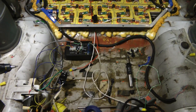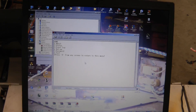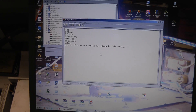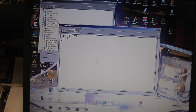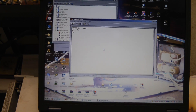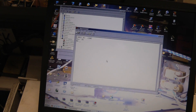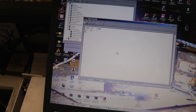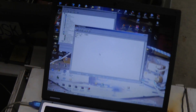Now let's see if we can communicate to it over serial. Okay, we're connected and that's working — just serial at 19200 8N1, no flow control. Let's see if we can drive the contactor. Force outputs — K2 is the drive contactor. How do I set it to yes? Yep, there it goes. You can hear the clunk, and the light flashes. That seems to work now.